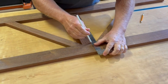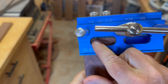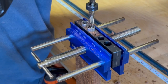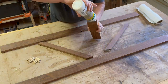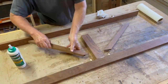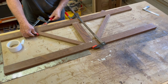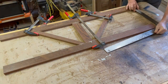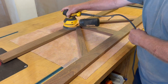This is the frame for the backrest of the bench, and again I'm just going to use this simple doweling jig — much easier on the three quarter inch thick wood to get the lines all matched up. The glue up is pretty straightforward. I did make use of some double-sided woodworkers tape and some of the 45 degree cutoffs to help with the clamping of the angled pieces. With some light sanding of the joints after the glue is dry, the back support frame is complete.